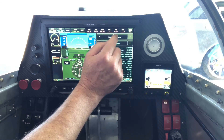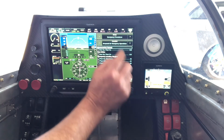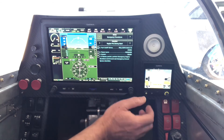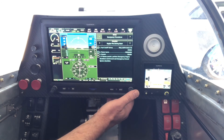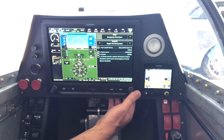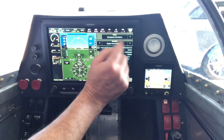It's pretty cool that I've got all this. If I have an emergency — say an engine fire during start — we want those fuel cutoffs pulled, power lever all the way forward, and crank the starter to pull the engine's flames into the engine. If the flames are persisting, we go to the engine emergency shutdown checklist, and then the ground emergency egress checklist. Pretty cool, pretty complete.